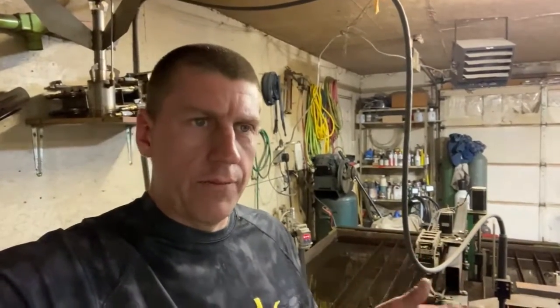The second most important attribute of this burner is the vast amount of air throughput involved. Because we have a blower and we're not using natural convection or aspiration, we're pumping so much air through there in a given moment of time. So we're not actually increasing the thermal heat capacity of the air, but we are increasing the thermal capacity throughput because of the blower.